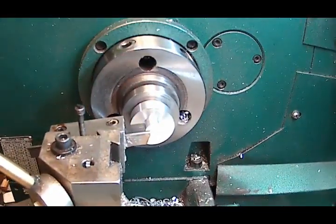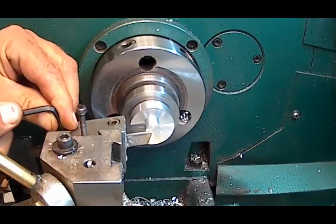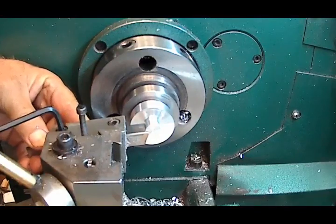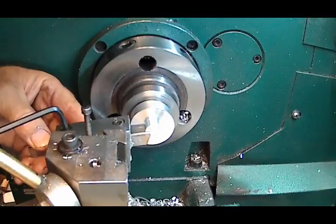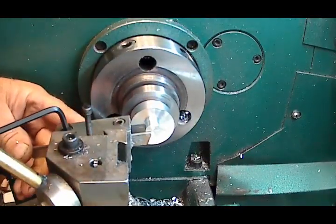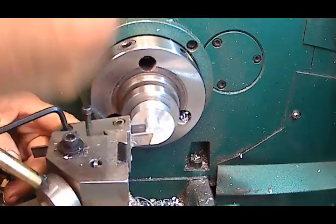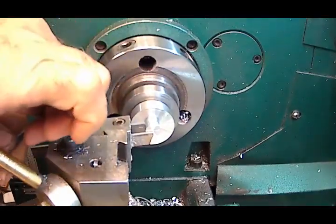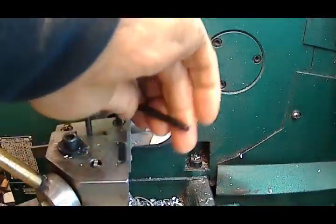And now I want to pull that blade back a ways. It does not need to be sticking out that far. So pull it back a little bit. Go back that far. Nope. Gotta go right to there. I'm just eyeballing the end of the blade to the center of the stop here now. Maybe just slightly beyond it. And then we'll check the height here, as quick as I get this tightened back up.